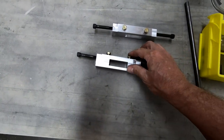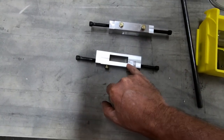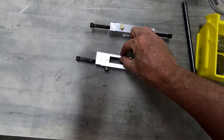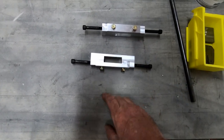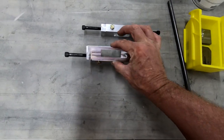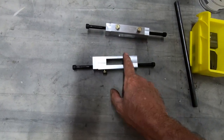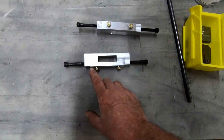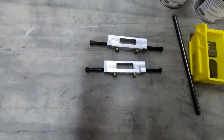The plans do show that if your gear leg is taller, you can work this lower edge on this fitting here to make it so that the gear fits. And we've only got 6 millimeters of thickness on the top here, but down here I've got 9. It doesn't seem to make sense to me that the bottom should be thicker than the top, when this is installed in the airplane, all of the weight is pushing up. It's being held in, this is holding the spring gear in here at the top. This clamp is just keeping it from falling out. So I'm guessing I probably could just trim this off if I wanted to, and I haven't decided exactly what I'm gonna do, but I'll figure that out.